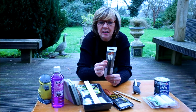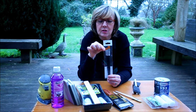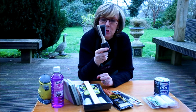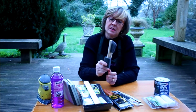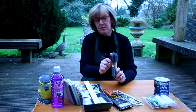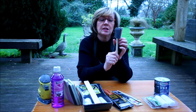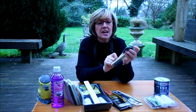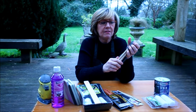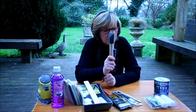And then these ones here are even better for small pieces of decoupage or small areas, or if you want to do a little bit of hand painting, these tiny little brushes here. And our foam brushes. These are invaluable for so many things. I use the 2-inch for my high performance top coat because you want a nice flat stroke all the way across like that. So that's what I use these for. And the 1-inch then I will use again for cutting in. And they, like the foam rollers, give a very smooth finish, like a sprayed finish. You don't get any brush marks with these.